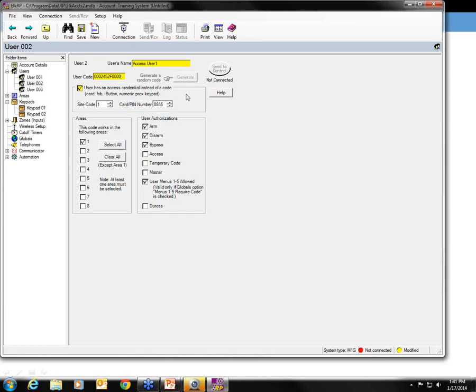Okay, another question that I have is, what size system would you recommend using in an ELK access control platform? What size system would you use M1 for access control? Is that basically the question? Yeah, we can answer that afterwards. Okay. Just to address what I thought the question was very briefly, the M1 system is limited to 16 points of access and 199 users, so it's definitely not going to be for large-scale access control. You are looking at smaller scale for the M1 to handle that.